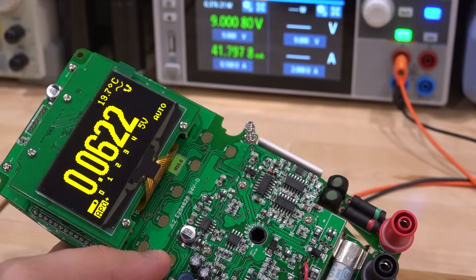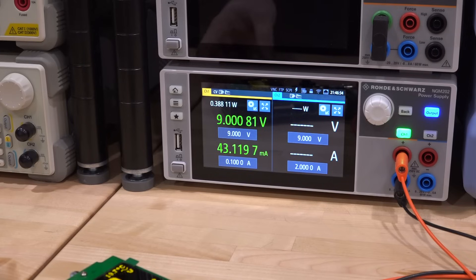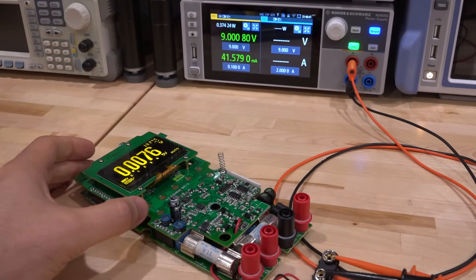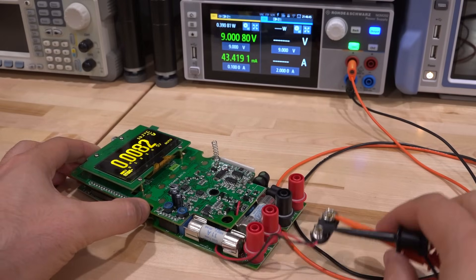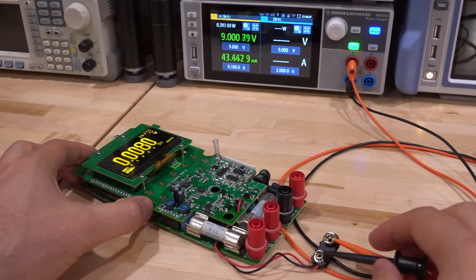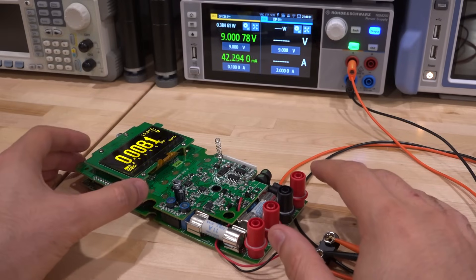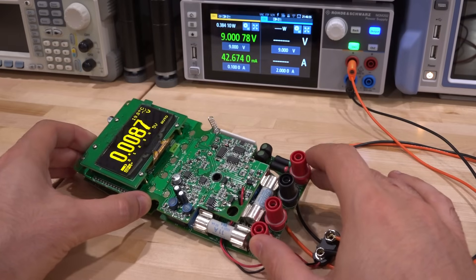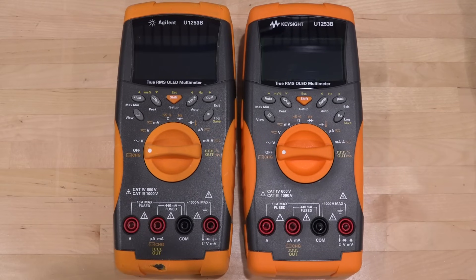This is a good replacement kit — look how bright it is, and the contrast ratio on OLEDs is of course very good. Now this thing is burning 0.38 watts, which is significant and part of the problem with this series — it does run out of battery fairly quickly. It comes with a rechargeable 9-volt battery, but I think the choice to use a 9-volt was a mistake. It should have gone with multiple AA batteries and figured out a way to optimize the OLED's power supply better.